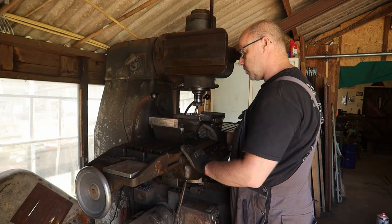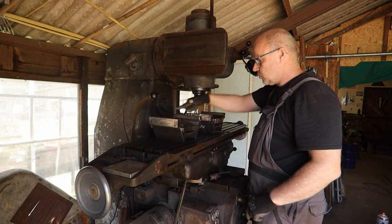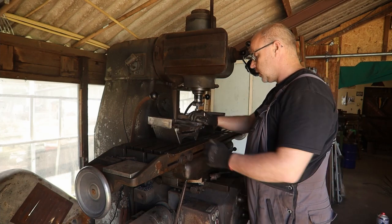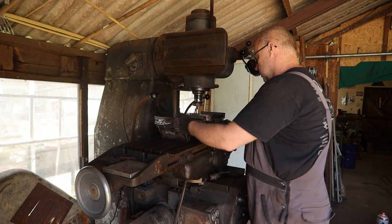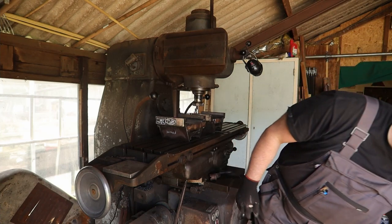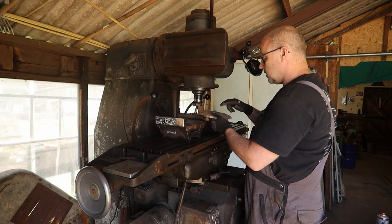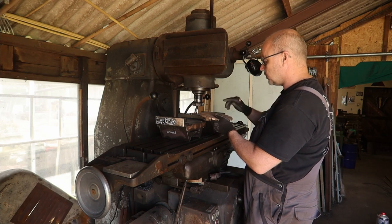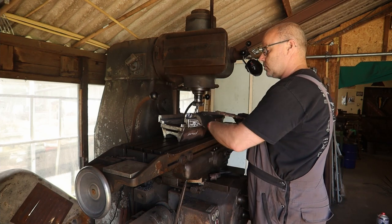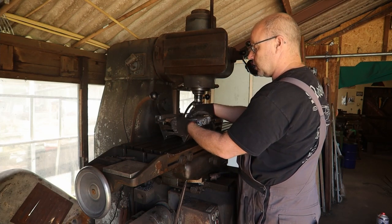Now we'll clamp them down like this. You need a chamfer on these two edges and a smaller one on the outside edge to clear the elevation part. So I'm gonna do that now, and when that is done I can take this mill, but I need an adapter for this holder. Put it in here, and then of course I need to turn it again, and I can start milling here.